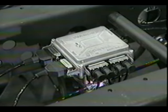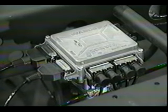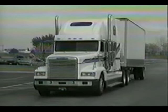Even though fault codes no longer blink, the repaired codes are still stored in the ECU memory. We'll explain later how to erase them. If you've replaced a wheel speed sensor, the vehicle must be driven over 4 miles per hour to get the lamp to turn off. The second level of diagnostics is the expert mode.